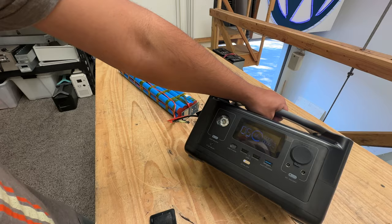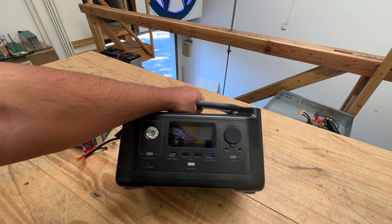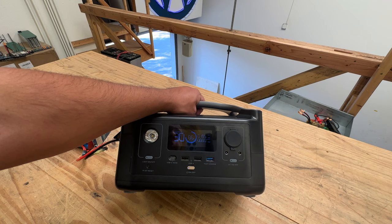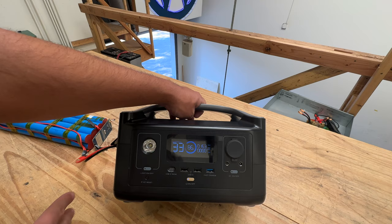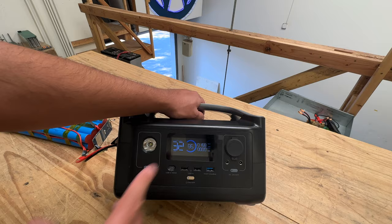Let's turn on this unit. It's at 86% right now. It's putting out 150–200 watts and bouncing around. The reason it's bouncing is because it's an MPPT solar charge controller — it's trying to find how much it can push to get the most power, which is what it normally does with solar panels. It looks like it's settling at around 180–195 watts, bouncing a bit, which is normal. We're connecting a battery into a port made for a solar panel, so this is one of the workarounds you have to deal with.